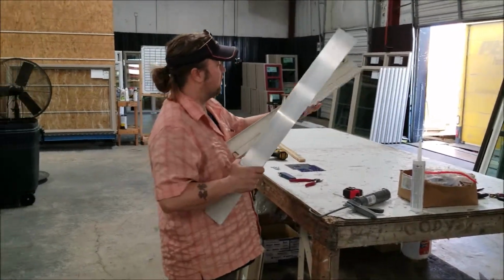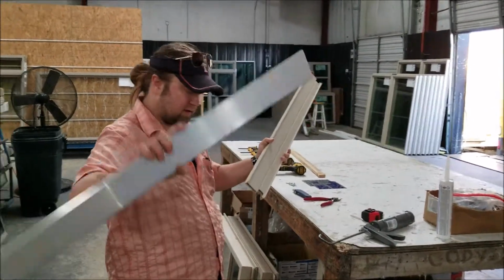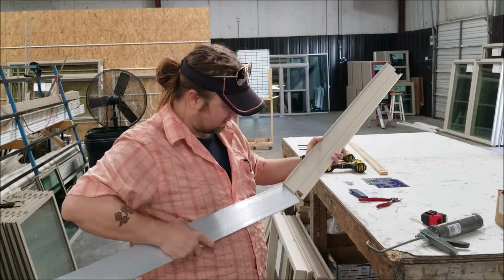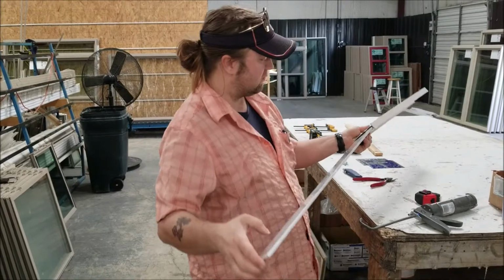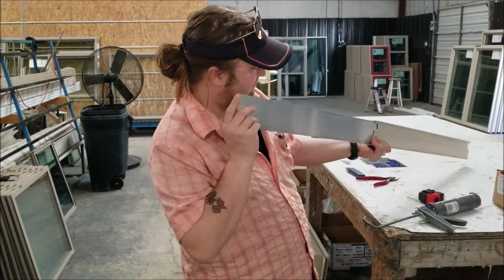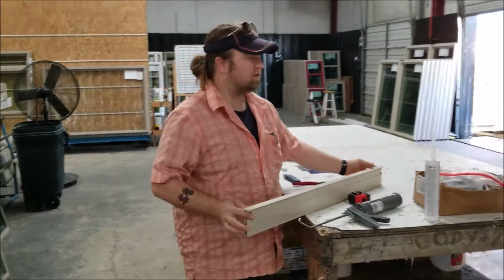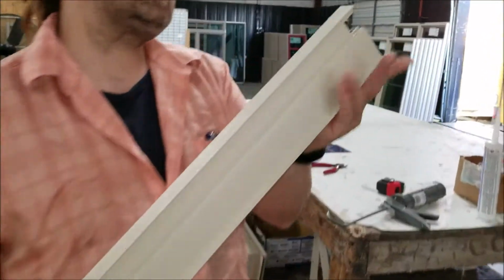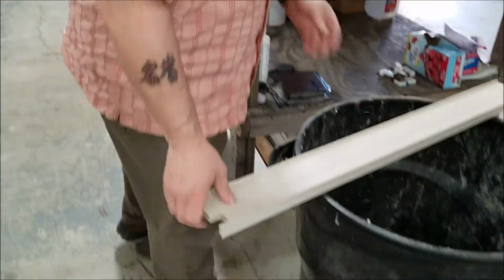Now what we're going to do is put the mull together. In most cases, the reinforcement is already slid in. This is to hold the unit together and give it structural rigidity. So we're going to put in a piece of aluminum reinforcement. It's milled out to fit right down the channel. It is 1.5 inches shorter, so where it's notched out, it should fit flush on either side, and you want to make sure it's flush on either side.